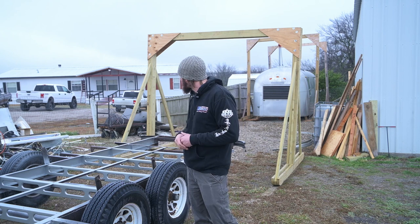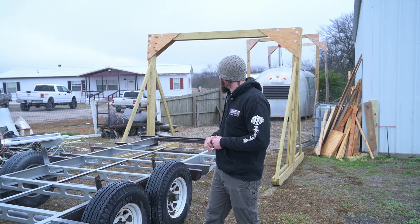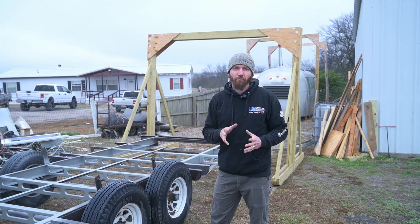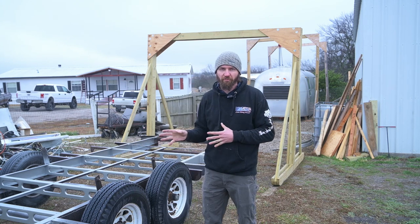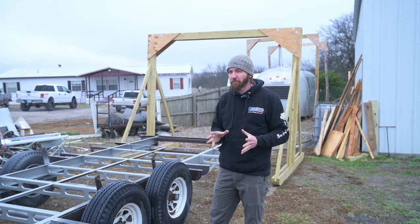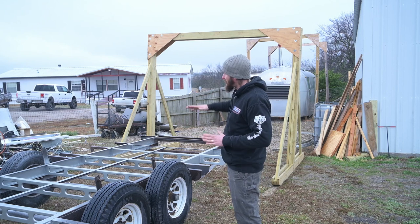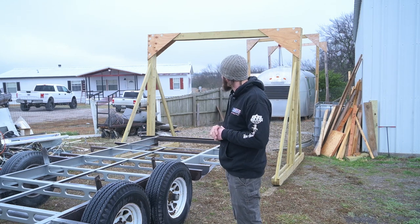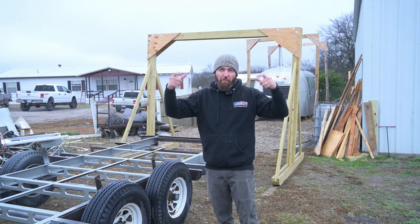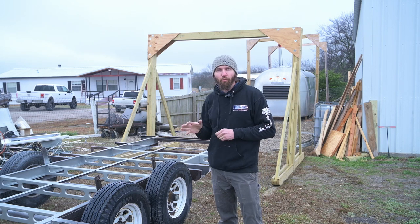The first part of that — I'm not going to show you a whole lot of it because it's kind of the easier part — but we built shorter versions of the gantries. You can get the plans for these gantries through Andy Rawls, there's a link below. He's a really awesome dude doing an Airstream renovation, but he's primarily a woodworker and he made the plans. We modified them by making them shorter — only eight feet tall — and we moved the supports for the uprights to allow our rotisserie device to move up and down on those uprights.